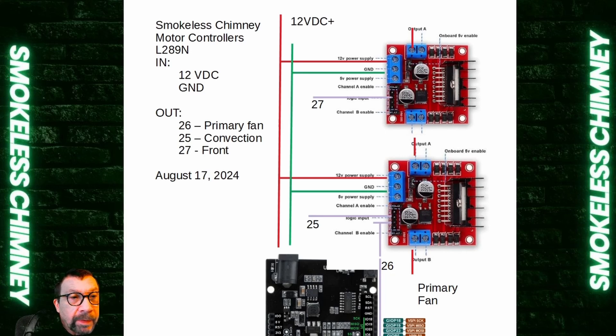I run 75% of that modulated signal to the front fan. The convection fan is different in that it goes to a separate fan that turns on based on a temperature signal. It turns on lightly when the stove is warm and much more strongly when the stove is hot, then decreases as the stove cools down. A convection air fan is not the same as a combustion air fan — it's used to spread the heat through the room off the stove.